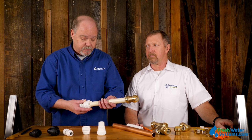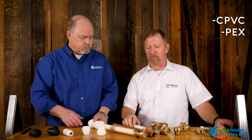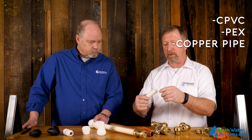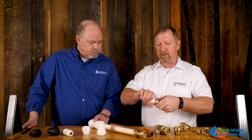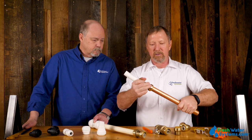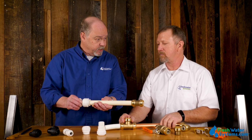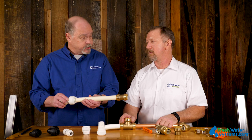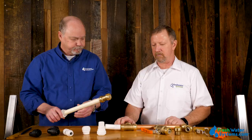What kind of tubings are these good for? This is CPVC. SharkBite can be used on CPVC, PEX tubing, or copper pipe. With PEX tubing, you're going to use it with a tube support — check your depth, mark it as before, and push it into the fitting until it bottoms out. You can also transition different materials; if you want to go from PEX to copper, it's as simple as pushing each type of pipe into the fitting. The insert is also important when using PEX with the John Guest ProLocks because you need to keep that tube stiff so the grab ring has plenty of strength — the tube stiffener.